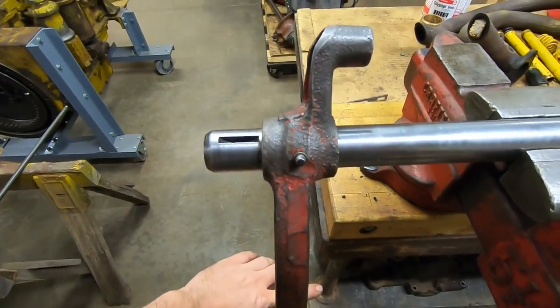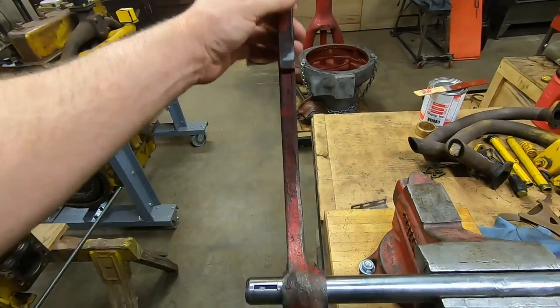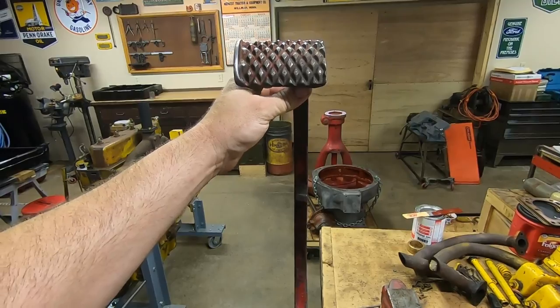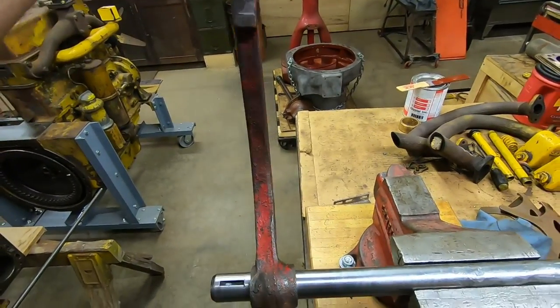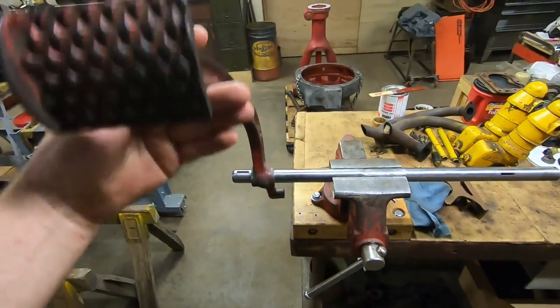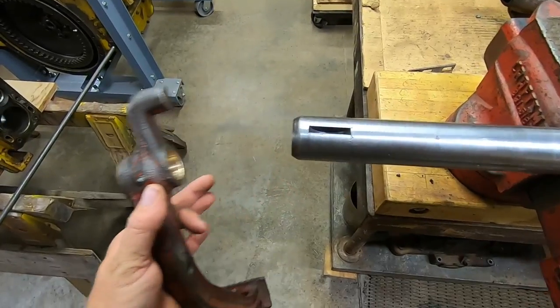So tested on the shaft, we're on the built up area. Nice and smooth. That's all the pedal wobble we have now. That is not bad at all. Just enough clearance for some grease in there. So much better than that eighth inch of play that we had before. I think we have a usable setup now.